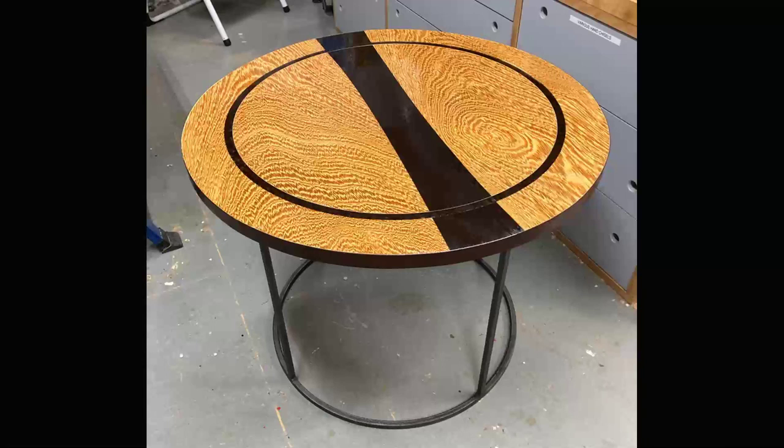I decided the table would now be smaller and proceeded to cut the outer rim off fully. I focused on the jig point not coming out, leading to a lighter grip on the router. Holy cow, it climbed out, to my horror, of course. Thankfully, it and the jig, this is his router we're talking about, going flat strap with a cutter in it, flew away from me, otherwise this may have been a rip Stuart. Off it went across the outfeed table and put a permanent reminder for me in the saw stop table, then proceeded to bounce off to attempt to route through the concrete floor until I got to turn it off.